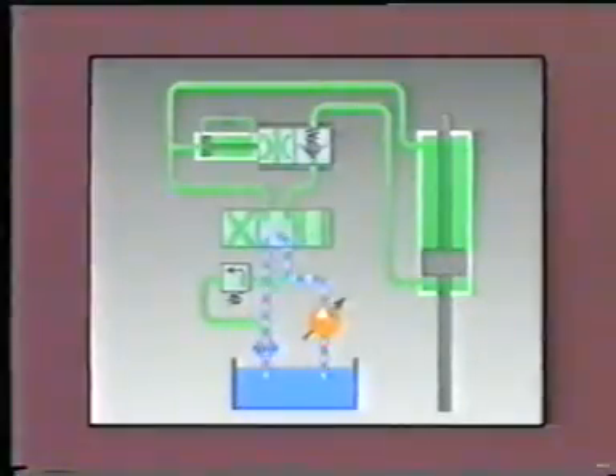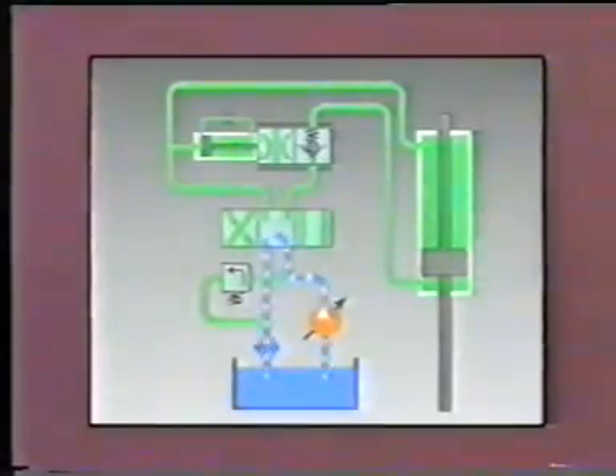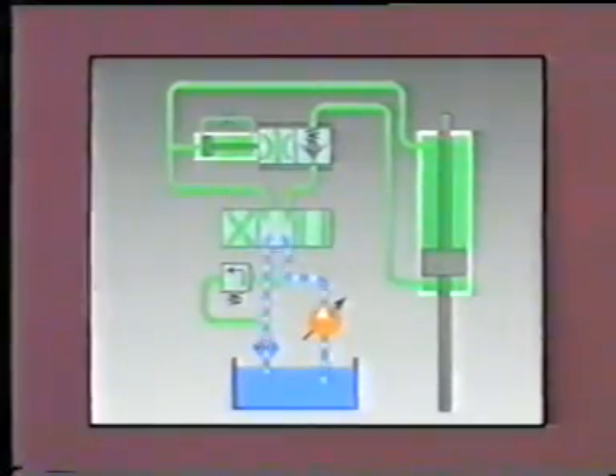A simple hydraulic system may consist of: a pump with or without variable delivery, a pressure relief valve to check the system pressure, a direction control valve here in neutral position, a flow control valve to adjust the velocity of the bridge, a hydraulic cylinder, and a filter to remove abrasive and other types of contamination. These parts are connected by pipe work.